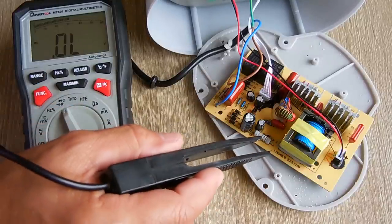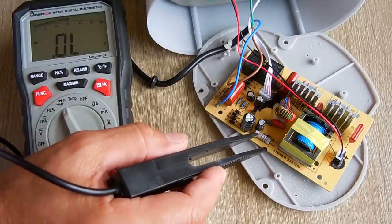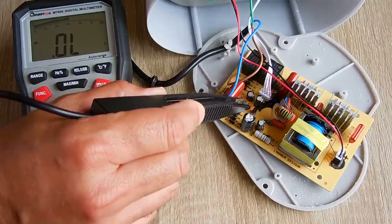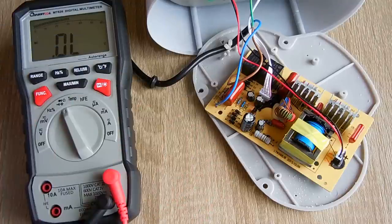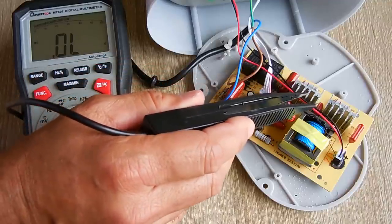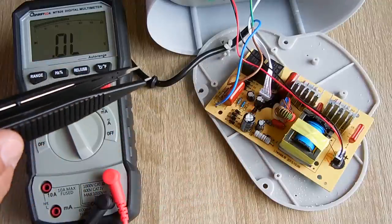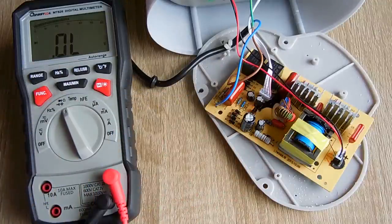And we'll see if once that's installed, 12 volts is generated at the end over here, and if we can end up with 5 volts coming off of the 7805. If we do, then there's no reason for me to desolder the base pins on the transistors to use the transistor tester, but I may just show you anyway. Okay, let me desolder that and pop in a new one.